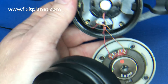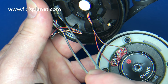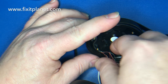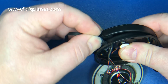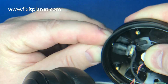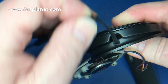Once those four wires have been desoldered, you still can't quite pull the cable out yet. The other two wires are still attached to the speaker and go into the headset — we're going to leave those as they are: a red one and a copper for ground. The cable is laid down in behind the standoff for the screw. We're going to push it out from the outside inward, then cut this end off and slide it through the hole.